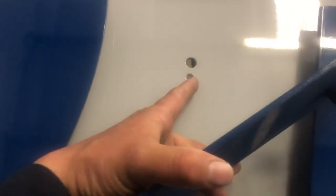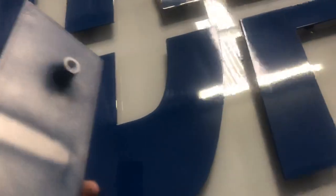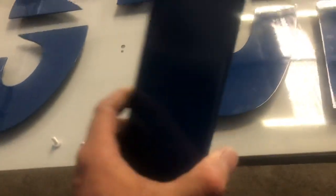You can see the holes right there at the bottom. The one hole right here is for the wire, so if I need to install any LED or anything like that, there's one hole underneath each ladder. The standoffs are welded where the holes were, so I don't have to measure or worry about measuring while I'm welding — I know it's going to be exact.